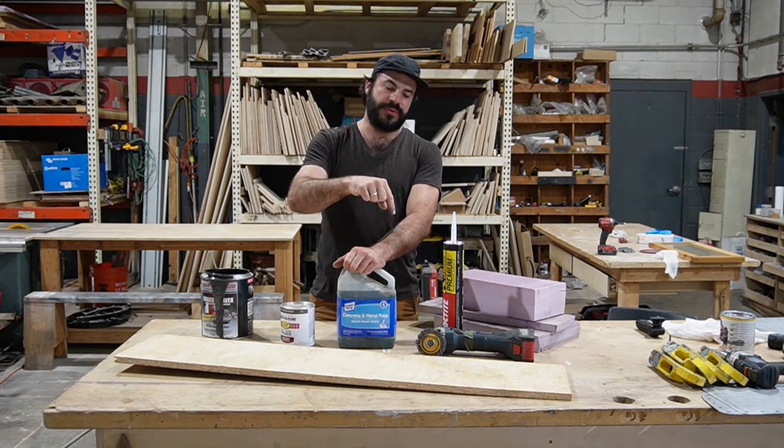So what I'm going to do instead is right here, immediately to the rear of the front stairwell is where I'm gonna have my step up. And so what I'll do is from here back, so this whole driver area back, that will be 4 inches, while everything from here forward is only gonna get 1 inch of foam insulation. It's the best I can do without opening up a can of worms and relocating brake pedals and gas pedals and, you know, really getting creative and kind of insane, frankly, with how I deal with the doghouse cover opening.